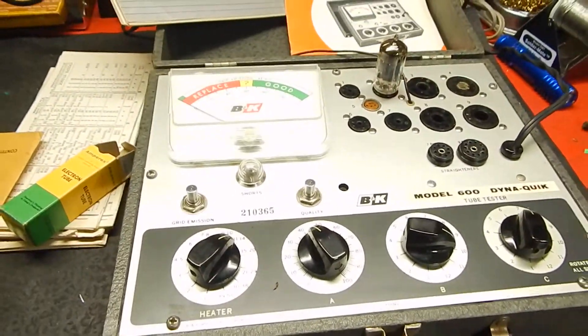Now we're going to check the other side. For the other plate, this is the only setting you have to change — switch this one up to seven. The first side on the quality, we're getting roughly about 92 to 94, around 93. That's really good. For the other side, the only one you want to switch is to number seven; the rest of the adjusters stay the same. You can see that's nice and even — so this is a real nice, equal-balance 12AX7.